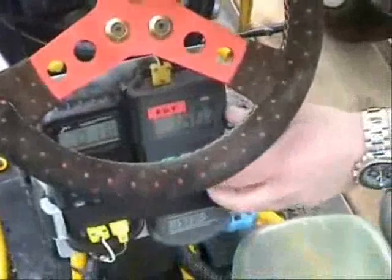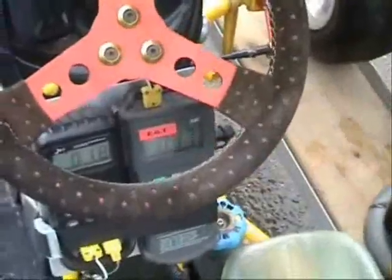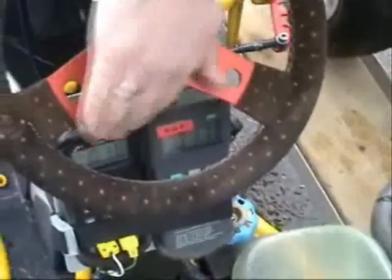What the procedure is: switch on your two temperature gauges. One's EGT — exhaust gas temp. That's the exhaust gas temp going into the afterburner, and that's the one before the turbocharger.